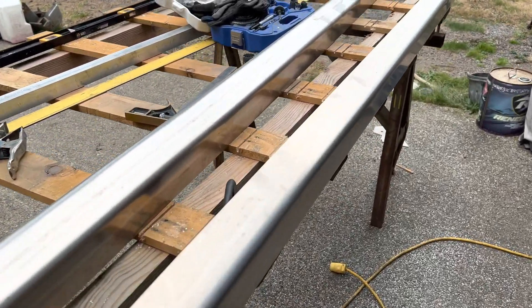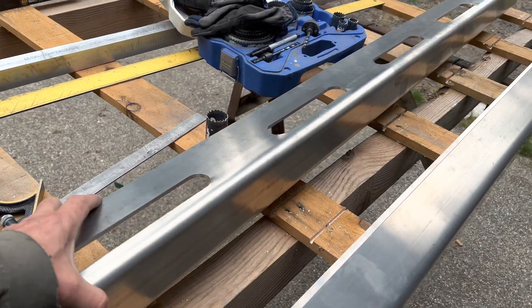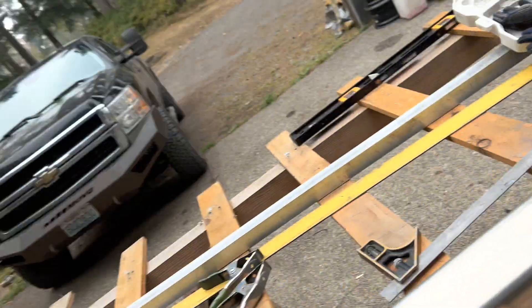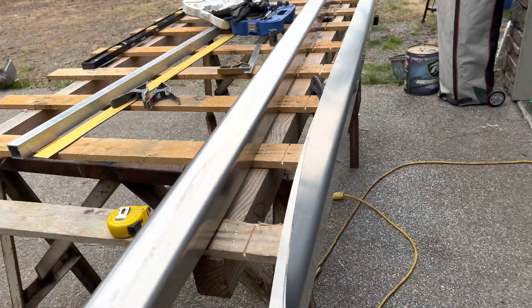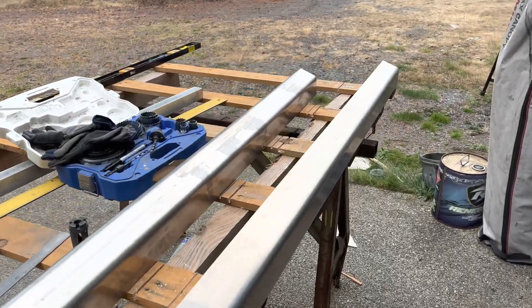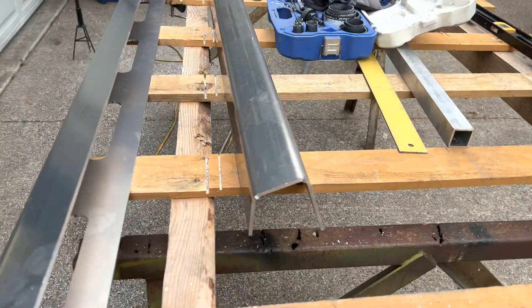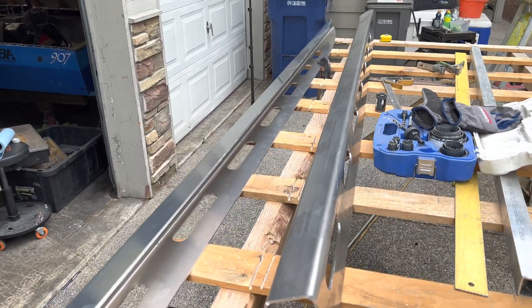It kind of gives the hull a little more rigidity, laterally and longitudinally. These already come pre-cut with some lightning holes and access to get into the engine mounts, but weight is everything for me with this boat in this class. So I'm going to drill some holes — lots of holes. This is a 1⅜-inch hole saw. I'll figure out how many holes I can get out of 3/16ths aluminum, how much weight — rough guess, a couple pounds, maybe 3 pounds. But hey, 3 pounds times 4 G's is 12 effective pounds removed.